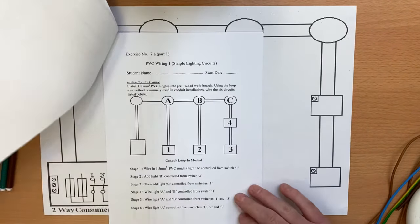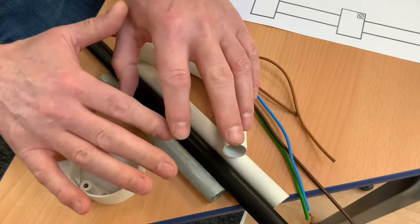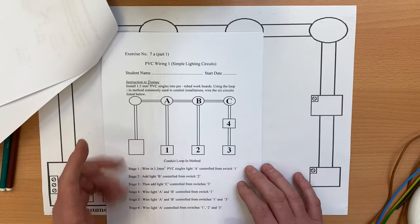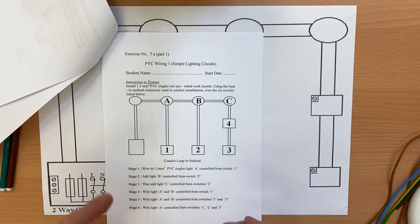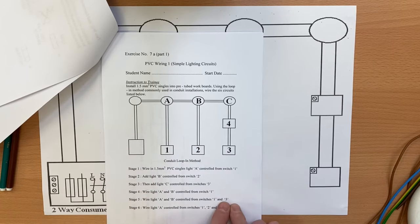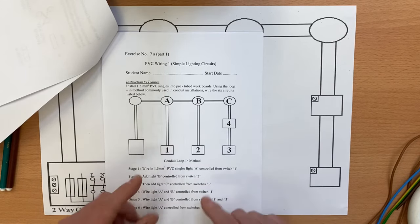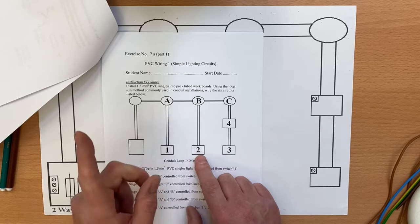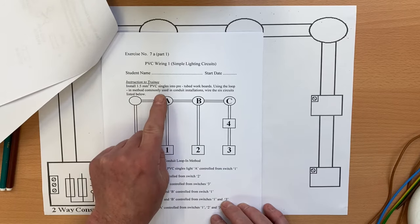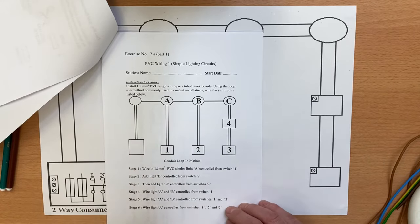We also suggested you can have a rig like this built at home in plastic or steel conduit — I'd probably recommend plastic conduit for ease. We've worked through stages one to four with wiring diagrams. However, I'm going to alter stage five slightly: we're going to have one light controlled by two switches to show the two-way method. Stage four was two lights controlled by one switch, but for this part I'll just do these two switches controlling this light, two-wayed.